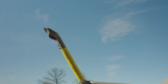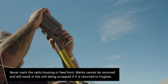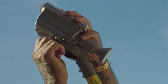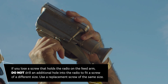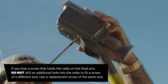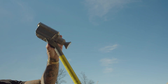The radio assembly will be mounted on the feed support arm. Position the radio assembly above the feed support arm so that the feed horn faces the reflector. Guide the two tabs on the underside of the radio assembly into the bracket on the end of the feed support arm so that they fit into the guides on the inside of the bracket. Be sure that the tooth key on the bracket fits into the slot on the underside of the radio. Insert the M4 Phillips head screw up through the feed support arm bracket from underneath and into the threaded socket on the bottom of the radio. Tighten until snug.